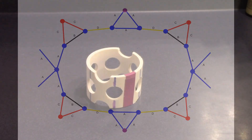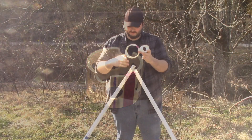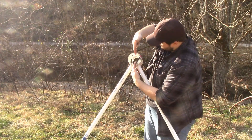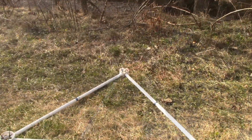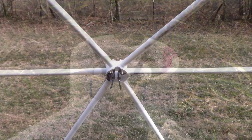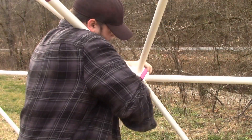The standard purple support hub will have curved slots along the edge of the hub. When you assemble the triangle, make certain the curved slots on the edge of the purple hub point up to the top and down to the bottom of the triangle, so that the support struts can be installed later. This will allow the support strut to be attached when the dome is complete.